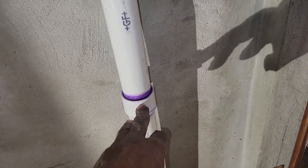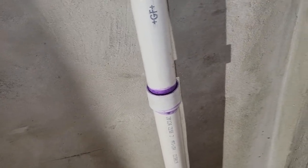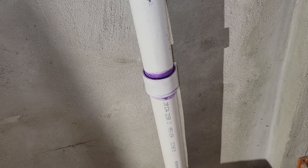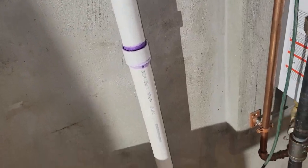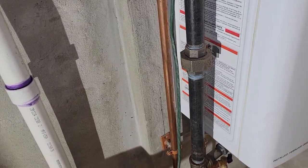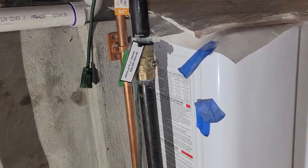At this point it doesn't matter. I tied back here — if you remember the old video, this was a cleanout; it was actually a female inch-and-a-half female adapter that was supposed to get a Studor AAV, but that was not going to work. So we had to go this way, and the vent is now hard piped in.